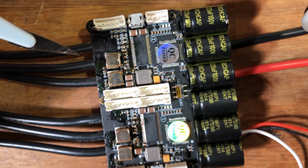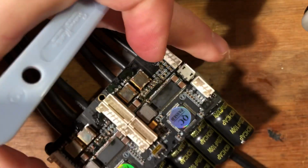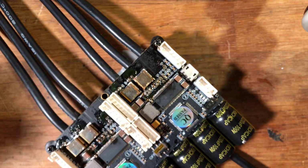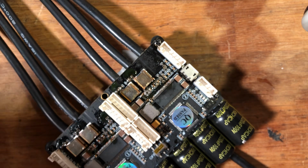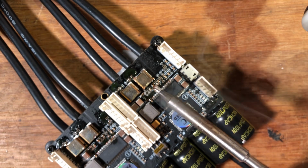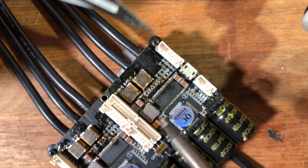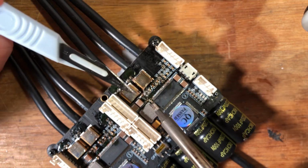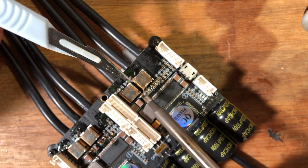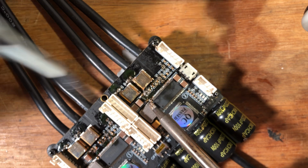Like so. And next up, not sure if I can do this on camera or not, but I'm cleaning the tip, adding a bit of solder on it, like so. So what I'm doing next is quite important, because the resistor will kind of stick to the soldering iron, and I can move it about and position it. And then I'm using the X-Acto knife to place it.